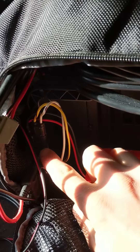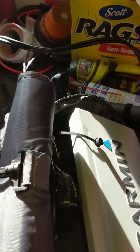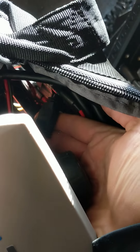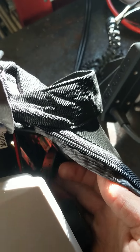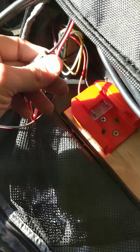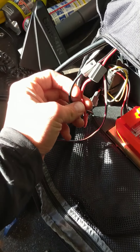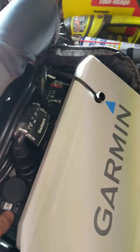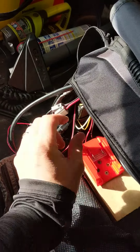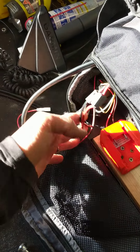Now this connector - this side of it - was already on the harness that they give you. Right in here is the breakout that they give you. This piece right here has one end that goes down and plugs right into the back of this. The other piece comes out and has these connectors on it. Now these connectors are what take power, and these two wires here come right from the LiveScope box, which is the black box. Those two big wires go right into the push connectors, so that feeds power from the breakout to the LiveScope box. There is a fuse in line with it too - it's just the way it all comes.